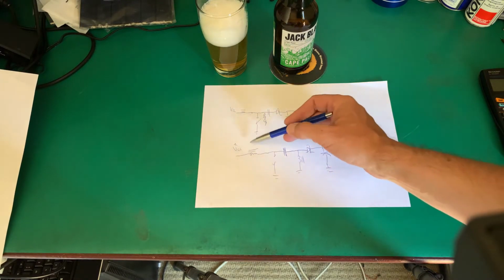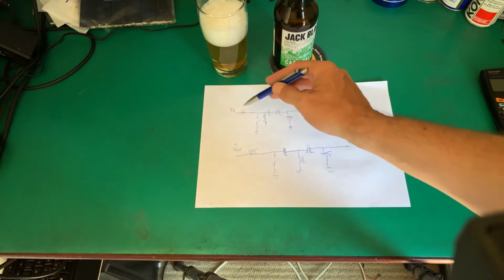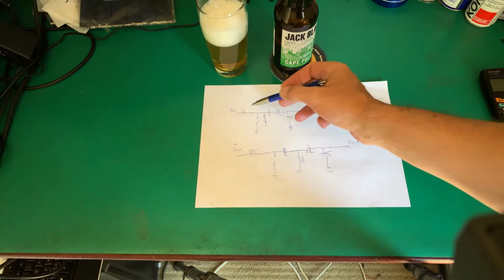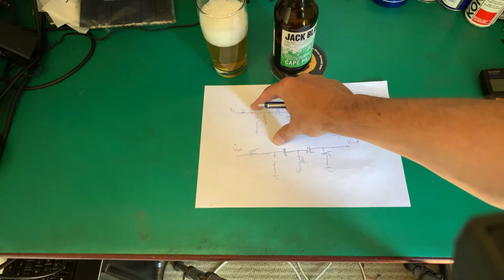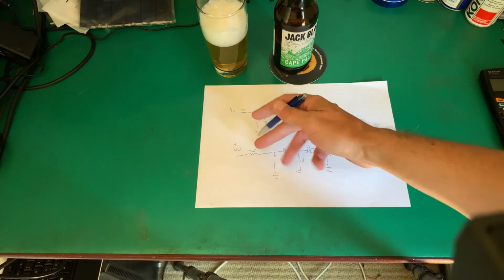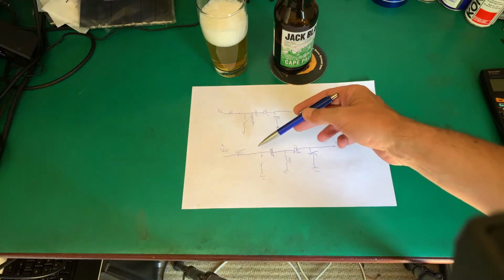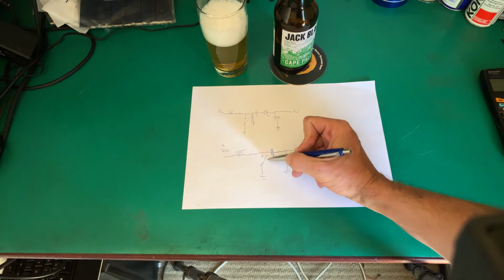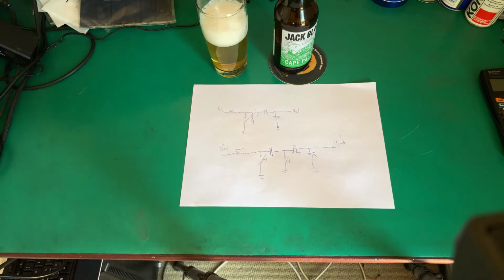The third advantage of this combination, because what we're using is a boost circuit. If you remember, in part 1 or part 2 of our video series, we talked about the boost circuit. We close that switch, the current will build up, so will the flux, and so we can increase the voltage. So SEPIC has quite a few advantages. Disadvantages: we now need two coils. So my thinking was, can we force the MC33063 chip to do this?